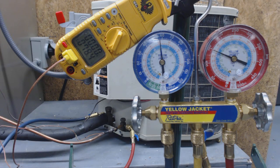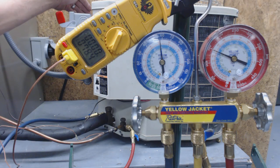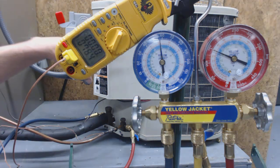Alright guys, this is the ADC Service Pack. I'm just quickly checking a refrigerant sub-cooling charge. We have an outdoor condenser on the rating plate. It says it's calling for 15 degrees of sub-cooling. The system does have a thermostatic expansion valve, so I do know the charging process for this is to check for sub-cooling.